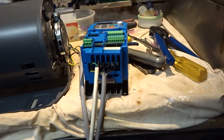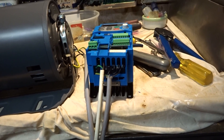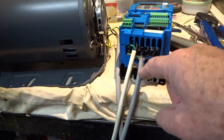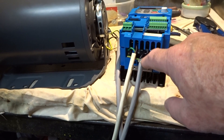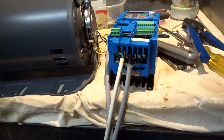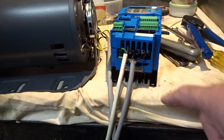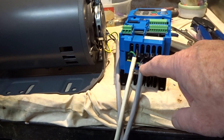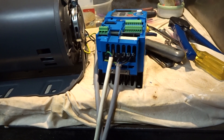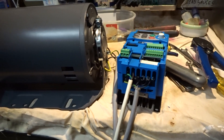And I have made a mistake. I suddenly realized in the instructions it says that the shielding — the metal shielding on the wire — should be connected to earth, and I haven't done that. So when I remake this I'll make sure I connect the metal shield to one of the earth connections, and ditto the other end at the motor.